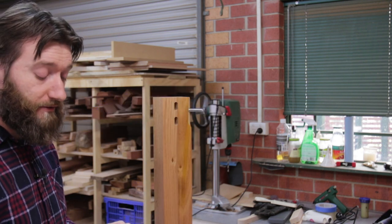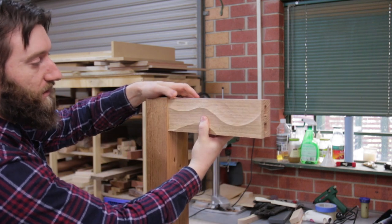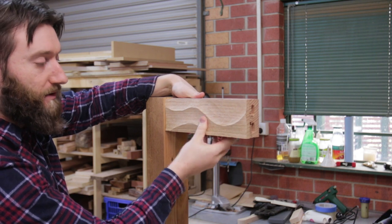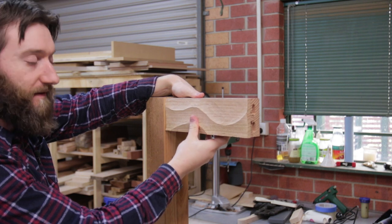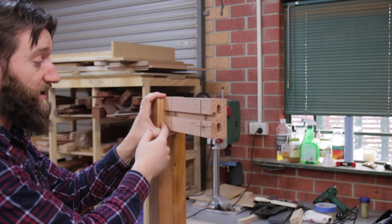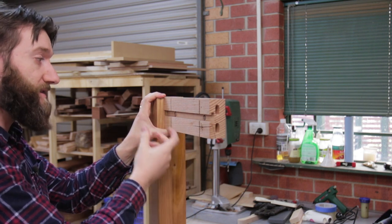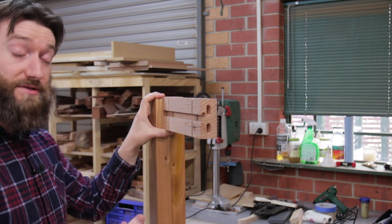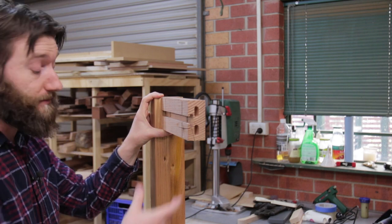If we plug in the apron you can see there's actually a fair bit of reveal here — that's a design decision to add some decorative panels to my table. With the decorative panel in place, the reveal is only a few millimeters, which is the design we're after. If you don't want such a large reveal but you're keeping the same leg and apron thickness, you'll need a larger chamfer. You can use a larger chamfer bit, rip the flat with your table saw, or build a jig that straddles the leg and use a router to remove that flat section.